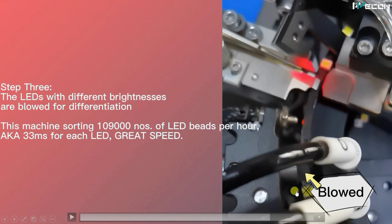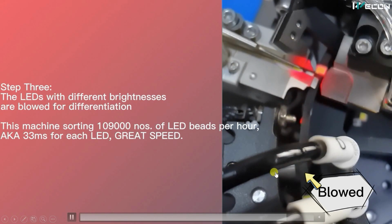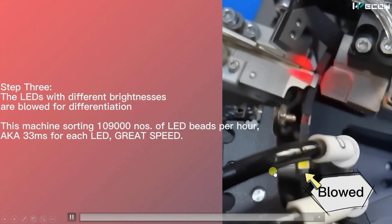And the final step is to blow out the LED in a different station. So observe here, when the LED comes here, you can see the ferrule over here. For each station, there are different wires coming. If this wire is energized, if the power flows from this wire, this particular valve will operate and it will blow the LED in this particular line. So you can see from here, when it reaches here, the valve is energized and the LED is blown out of the production line. Okay. So in this way, LEDs are sorted in the industry.